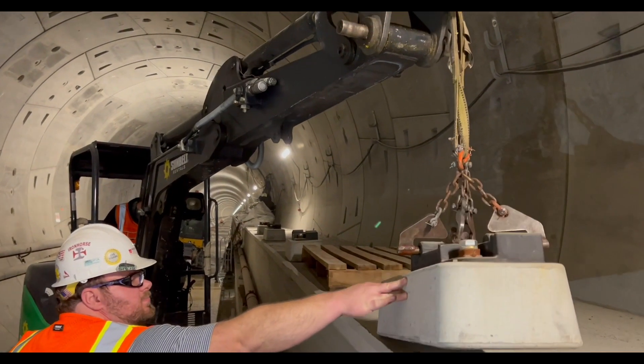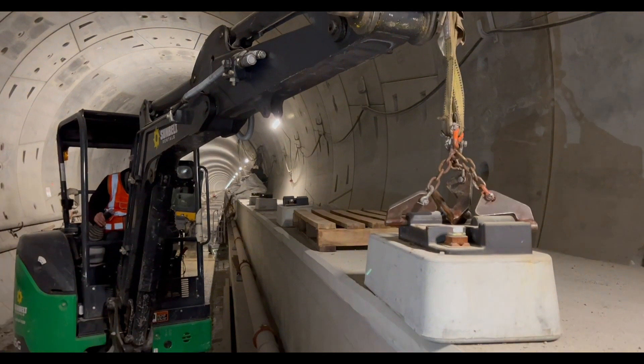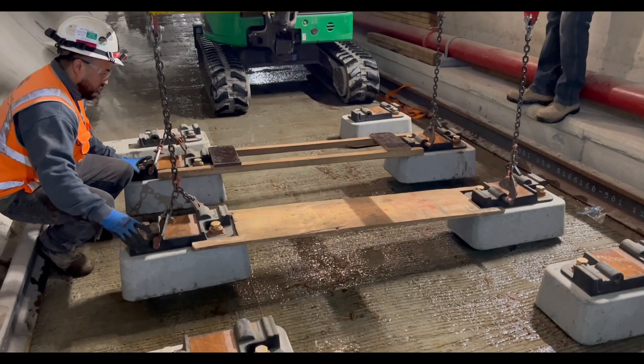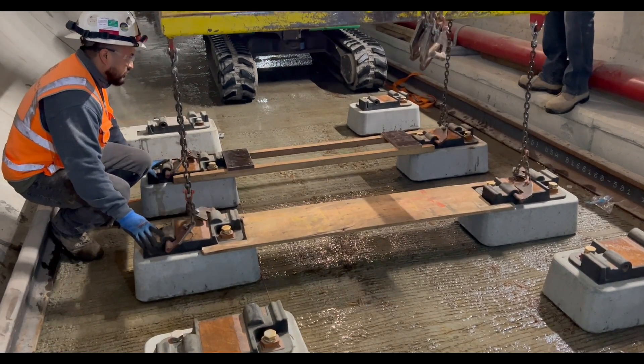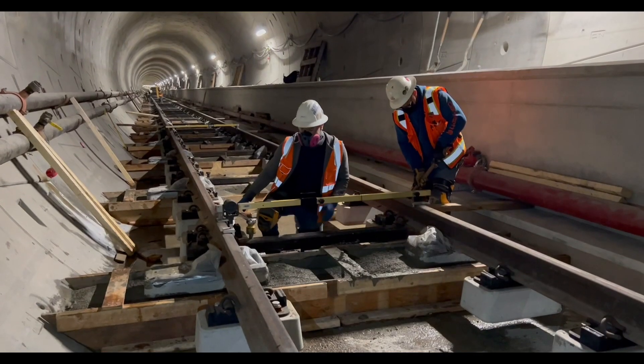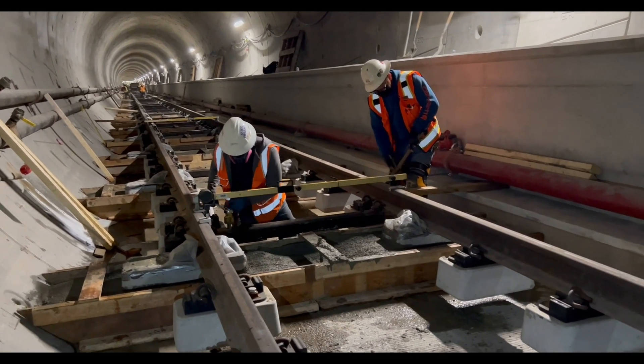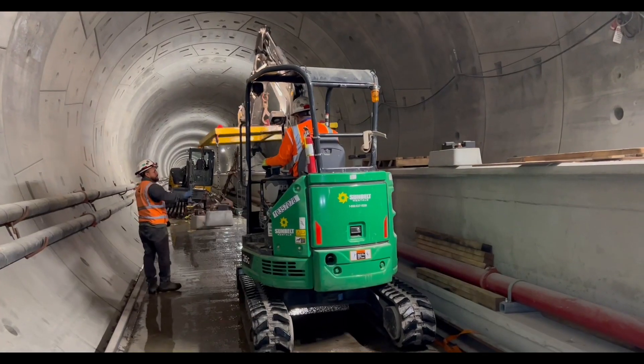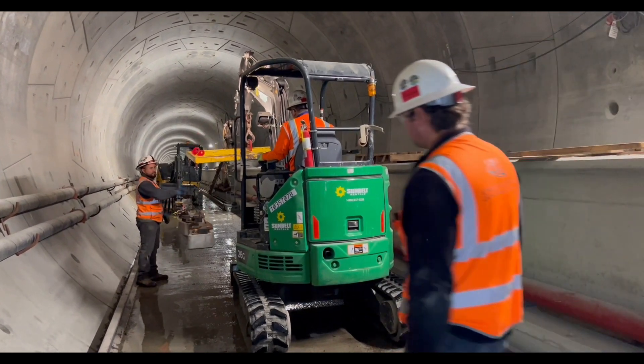This DF block is probably the easiest I've seen. I've seen blocks where you have just a standard shoulder with inserts going into the block and then you have to have some sort of encapsulation surround around it, and those blocks are very difficult when you're handling them, especially when you have to move them. But these blocks, since they already have the inserts for the fasteners installed, it's a very simple system and I'm using a lot less manpower than I've ever used on a DF block system.